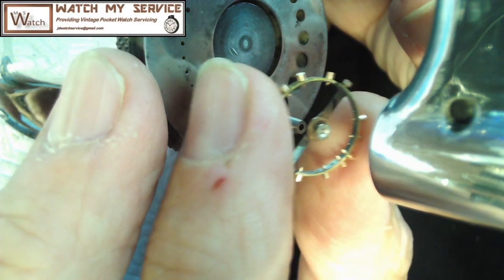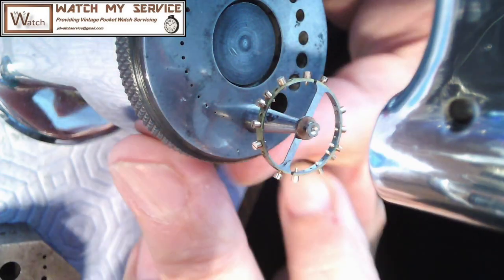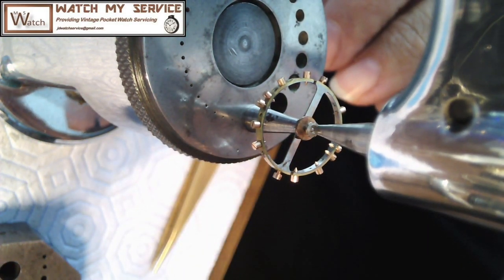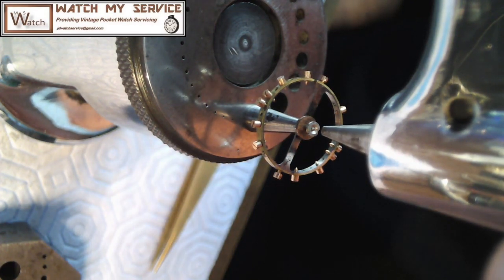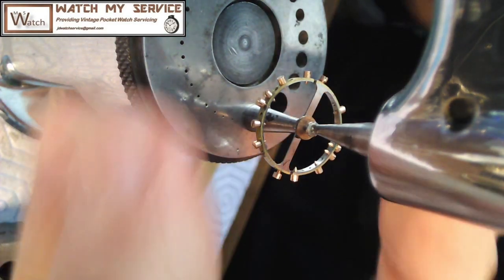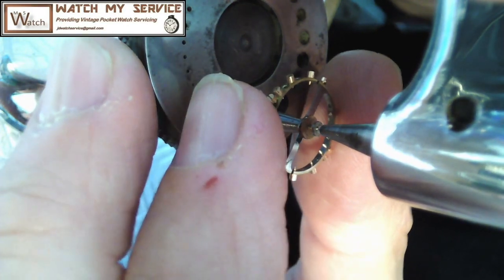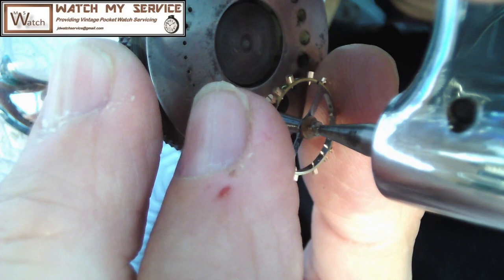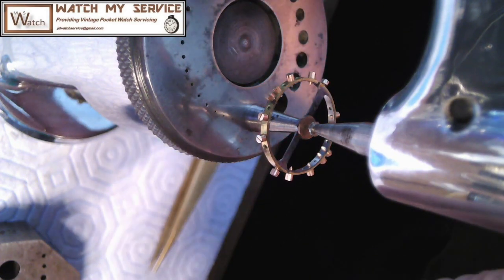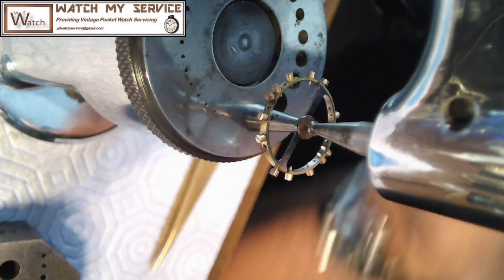I think I placed it on just to make sure it's perfect before I do any serious staking. The stake I use is the same one I used to put on the balance staff previously - it just needs to fit over the same staff. You can reuse these stakes. They tell you to go get a stump for this but you don't need to if you've got an inverto staking set - you can just use the stakes you have and it works perfectly good. Here I'm tapping it in.